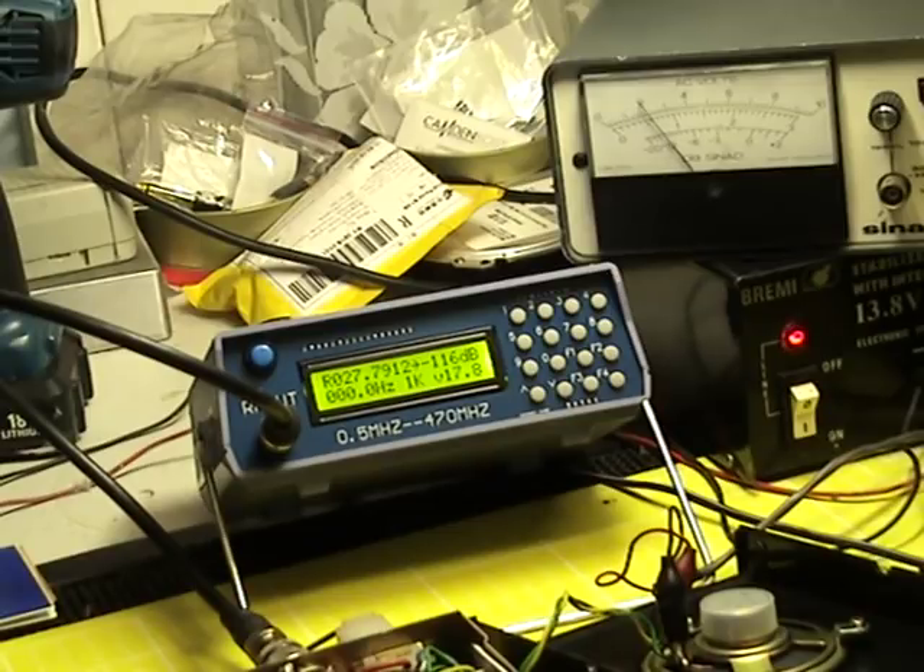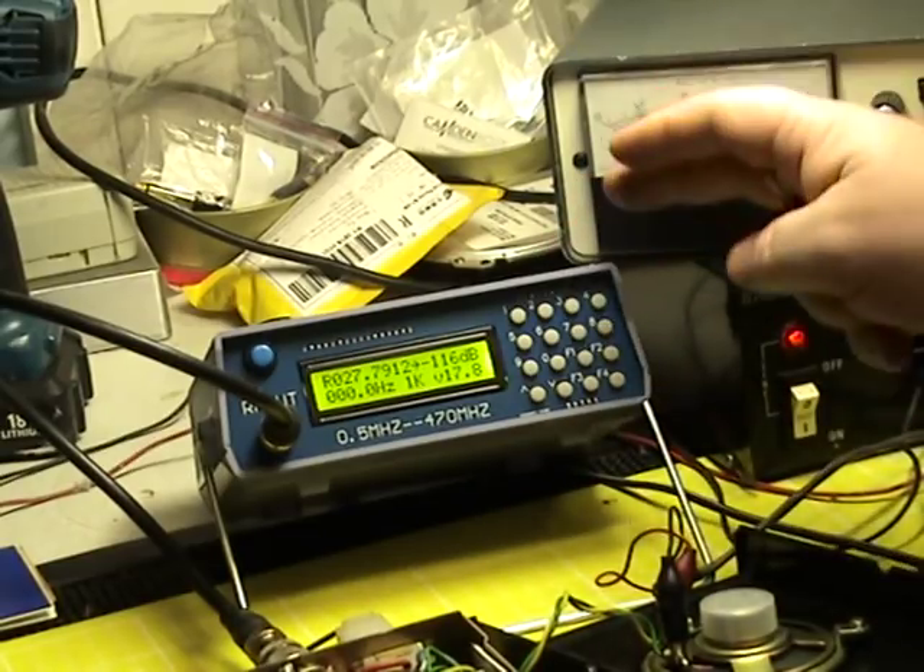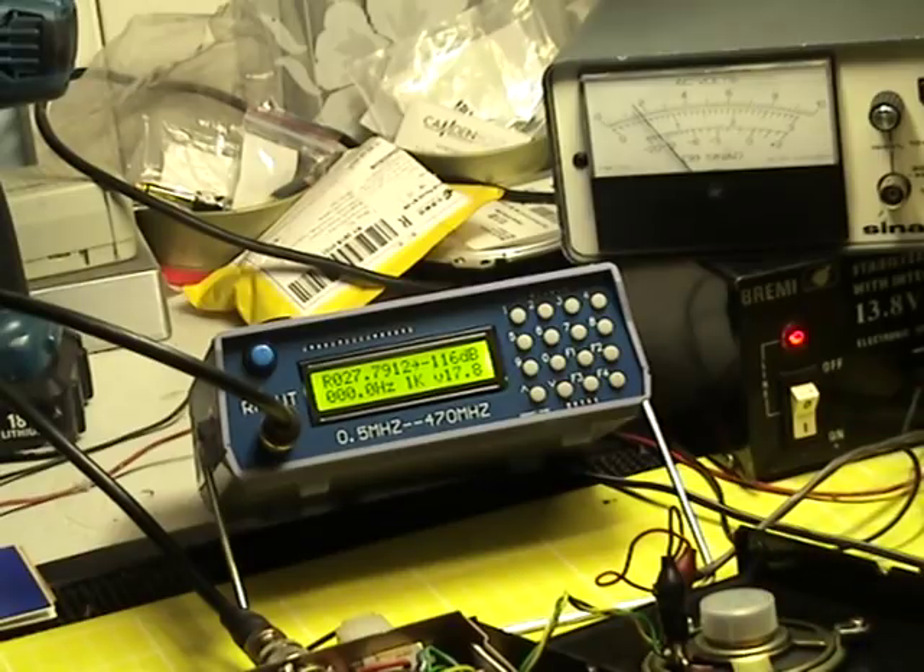It's not often I'm enthusiastic about instruments. The whole idea of this set of videos is doing CB radio tuning on a budget — we can all go out and buy 12,000-pound pieces of test equipment, but doing these things on a budget is another kettle of fish. So here we have a brand new cheap Chinese instrument from AliExpress for 56 pounds delivered, the second-hand SINAD meter — only had to clean the switches — for 90 pounds from eBay from a chap in Canada, and the dead cheap 10-pound power supply. It's a lot more convenient than the boat anchor AM signal generator because you're not having to mess about generating an FM tone with a CB walkie-talkie just to set the detector. It's all on there. Very impressive.